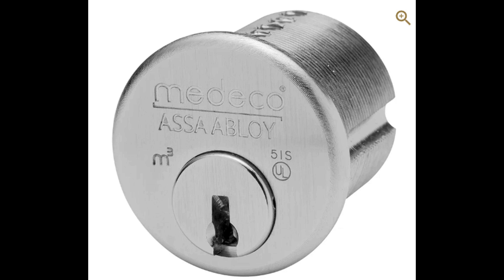Are locks already on the job site? Locks are already on the job site — they're flagged. I've got a few pictures. I think there are five different lock sets: office entry locks, classroom locks — different functions. When you look at the face of the trim, is there a cylinder or a core installed in the trim now? No, there is nothing installed. It's just an opening — you can see a recessed opening for the cylinder to be inserted.